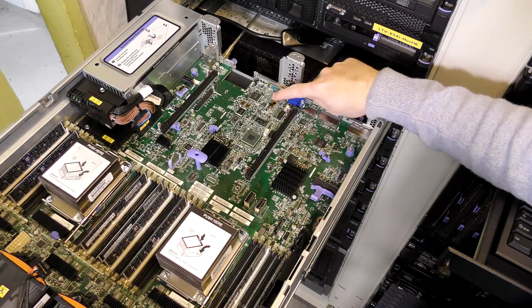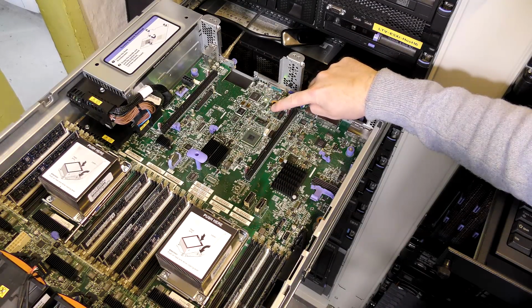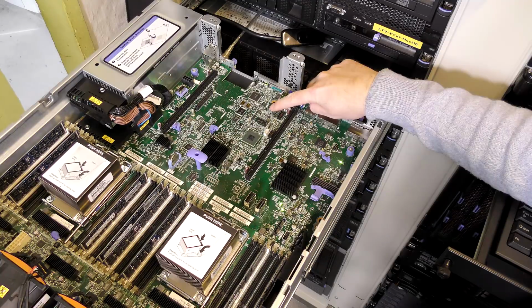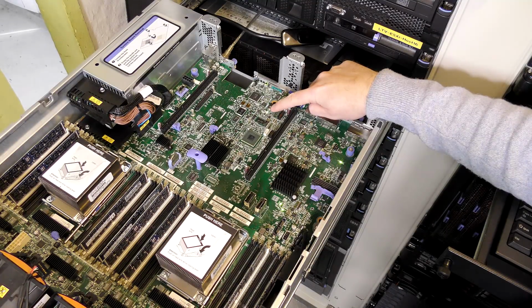Anyway, up here is an LED that blinks. I do believe that it's supposed to do that. And down here is another LED that blinks. And this is the IMM heartbeat LED. And that blinks as long as the data for the IMM is loading. This LED never stops blinking. It never comes out and says that it's done loading the IMM.